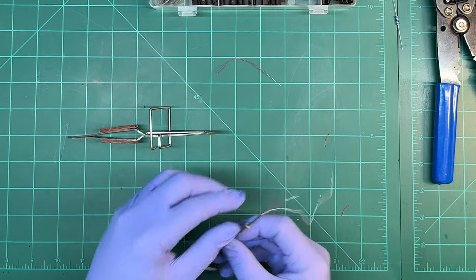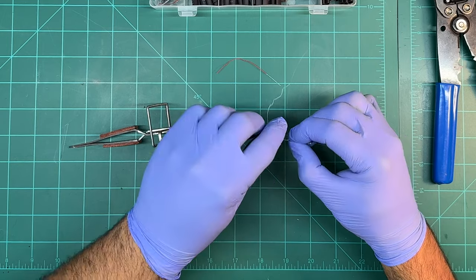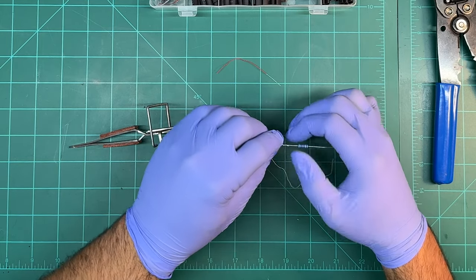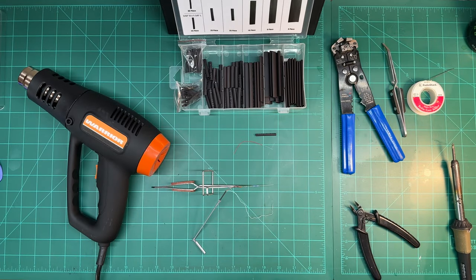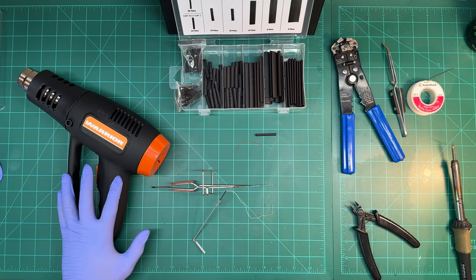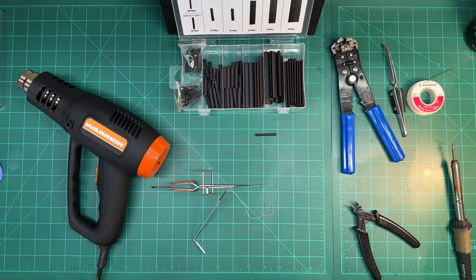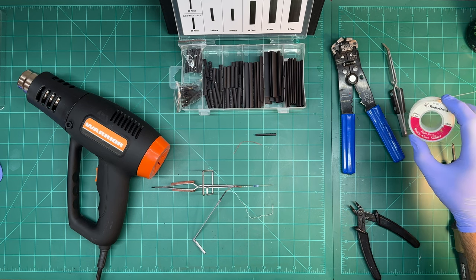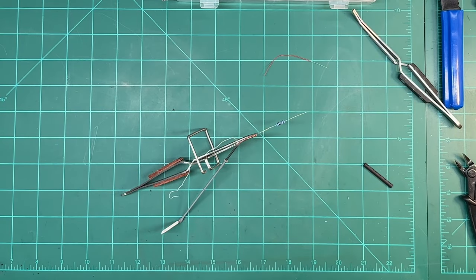What I'm going to do is attach this wire to the resistor - I'm just going to wrap it around just like that. Then I'm going to put them both together on the pliers. A couple of things I forgot to show you in the supply list: first is this heat gun - get yourself one of these. You can find it at Harbor Freight, I got this for about 10 bucks with a coupon. They're nice to have for the heat shrink tubing, though you could use a lighter - although there's a possibility you can melt the insulation on the wire and make a mess. Also, I use rosin core solder - make sure you get electrical solder.